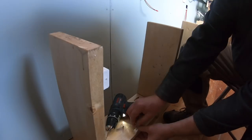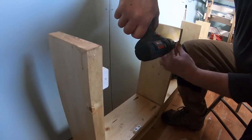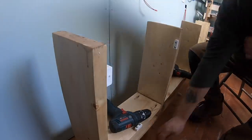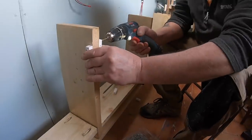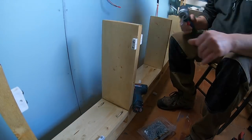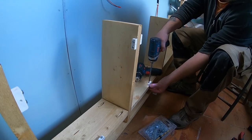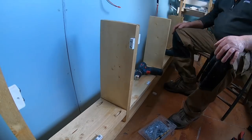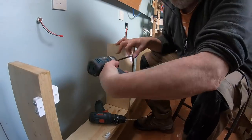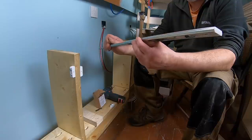These assembly joints are not only being fixed to this base unit to fasten it to the floor, they're also being used to keep everything square. The reason being for that is we're having slide out drawers in this base frame, this kick space under the actual carcasses. Because we're doing that, there's nothing at the front face of these to keep everything square. We can't physically screw or fasten anything to there to keep this square. So we're relying really on these to do that for us.